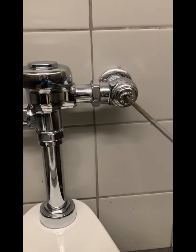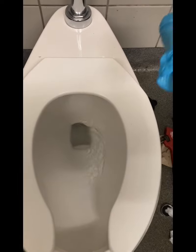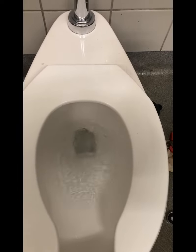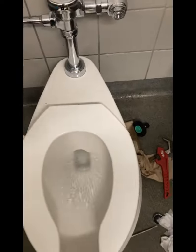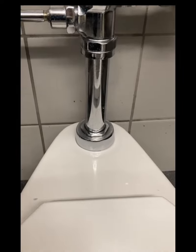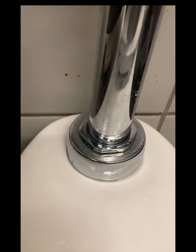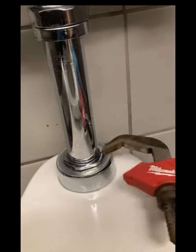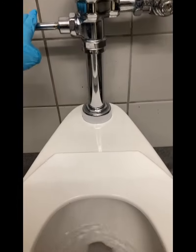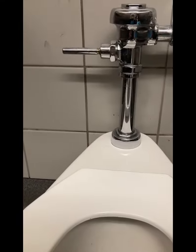After finishing that, I like to wipe down the flushometer so that if anything is leaking I can visually see it quicker. I'm turning on the water now and it is flushing — looks like it's working. I flush the toilet several times to make sure it's indeed working. As you can see from loosening that cap I also loosened the spud at the bottom, which is why I wipe down to spot any leaks. I take my spud wrench again and tighten it at the spud. After that, the flushometer is perfectly operational — that's all it takes to change the diaphragm for a Sloan Regal.